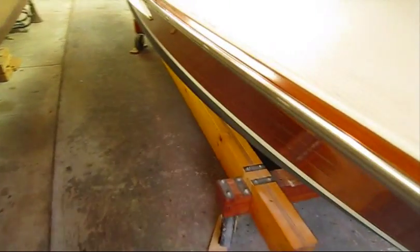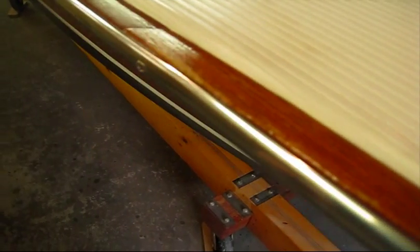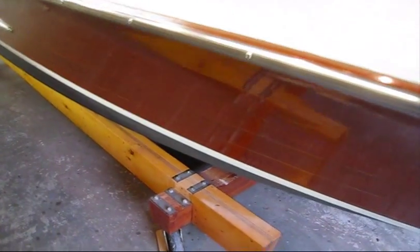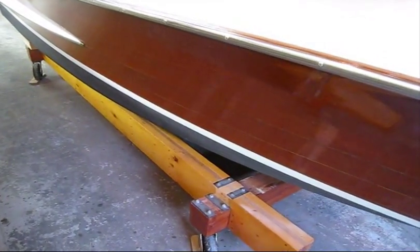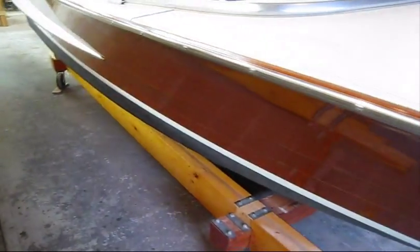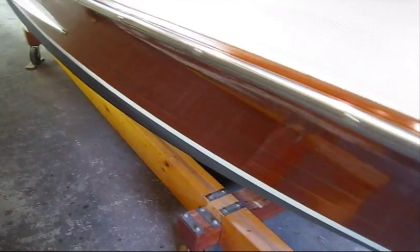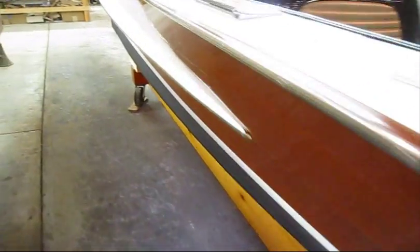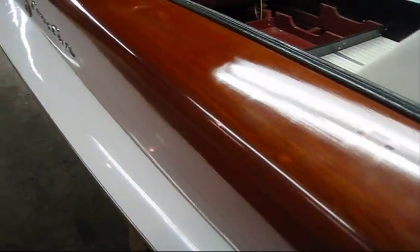The best time to varnish is really when it's still in good shape. If you get to the point like on this rub rail here — where it's worn right through — that's probably because this rub rail only has a few coats of varnish on it. But if you let it go too long and the entire hull side or deck starts to get like that, you pretty much need to refinish it. You could try to match stain but then it becomes real blotchy. So if you stay on the offense and varnish the boat every couple of years depending on sun exposure, you'll be okay.